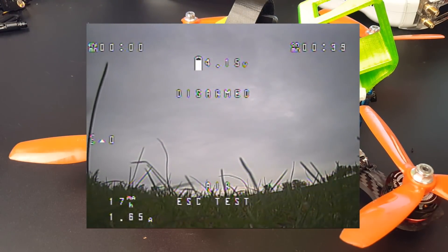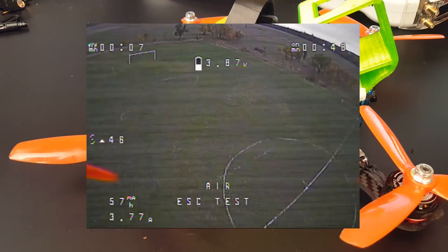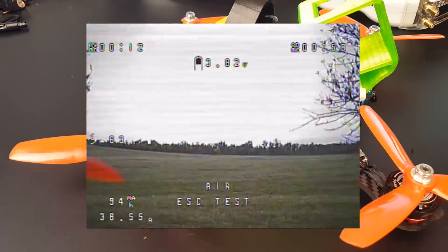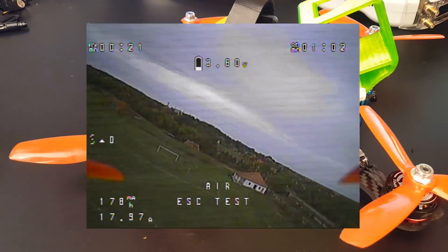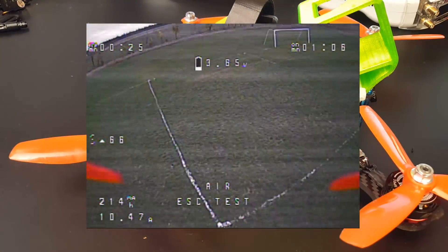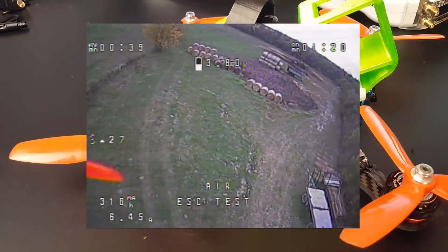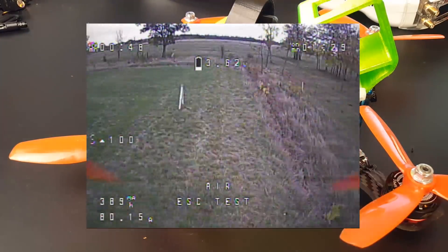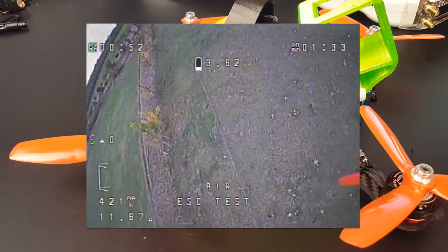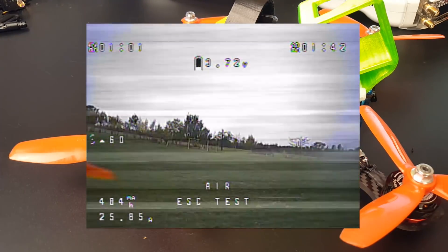All right, preparing everything. I left the throttle on the left in the quad's OSD so we can see at what throttle percentage we do get noise. That was just a full punch out where you can kind of see the noise when it's looking up in the sky. But overall, I think this is considered almost perfect — not quite perfect, there's a tiny bit of noise, but it will not affect or hinder your flying experience at all unless you're super picky. You'll still be able to see your gaps and go through them. I'll add a low ESR capacitor to make it absolutely perfect. I could also possibly clean out those hard-push noise spikes by increasing the PWM frequency to 48 kilohertz — that'd be pretty interesting. I should have thought of that when I was in the field. Overall, this is a pass for me.